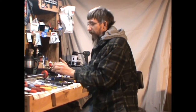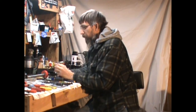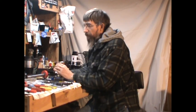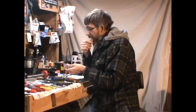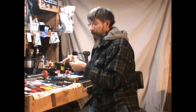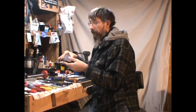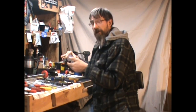One thing I did get: I was warned by a close friend that to be successful you need gauges. The firearms I built are 5.56/223, so I got the gauges for them — the no-go, go, and field gauge. Do I personally need those? No. But are they a really good thing to have, especially if you're troubleshooting or not sure of what you're doing and you just want to be right in the end? Yes.